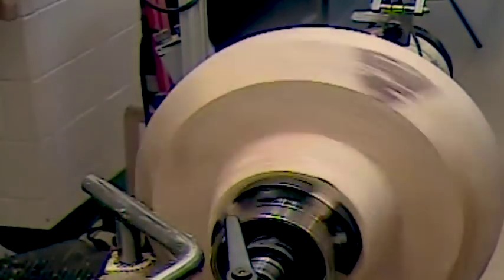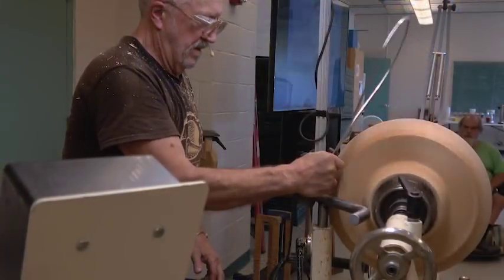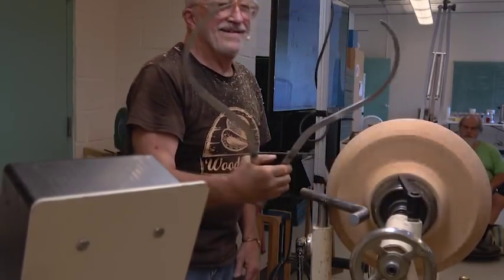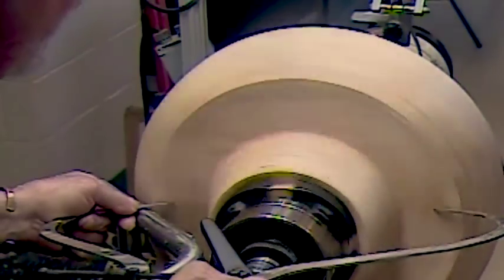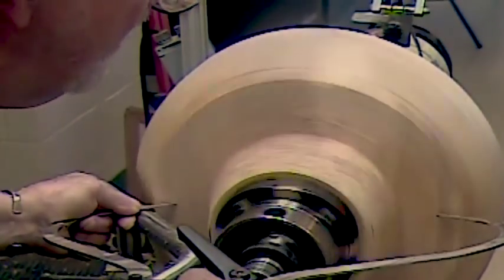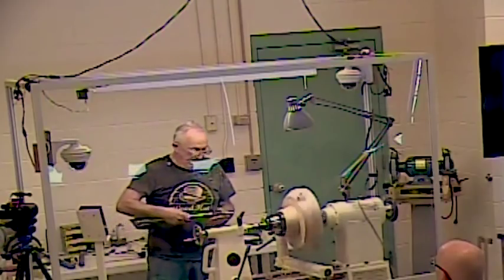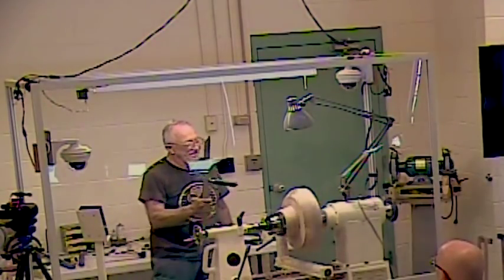So there's no way to stick a ruler through there to put that layout. So I used my big quick adjust calipers. Now I've got these points 10.5 inches apart, and I can come here like this and scratch a line. That jaw's not quite lining up, so I've got to move in a little bit, and when they line up, I push and I get a line. So now it's 10.5, I plunge in there. It's a mega parting tool that can make cores, put it that way. Not really a coring system, but you can make cores with it.